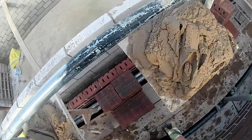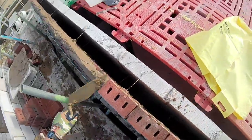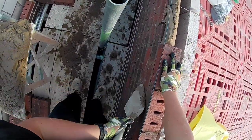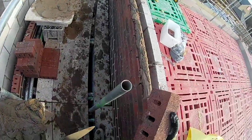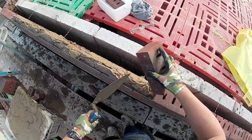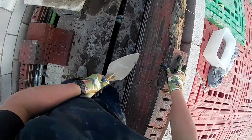Frame heights can also come high, so there are always things to be aware of. As long as you keep as close to your gauge to underside of joist - which on this house is 32 courses, 2.4 meters - you shouldn't go far wrong. If you're within 10-15 mil of that and all corners of your house are the same gauge, you'll be fine. If you're going to be 10 mil high, make sure the whole house is 10 mil high - don't just go to gauge on one corner and leave the rest different. You've got to make sure everything levels.